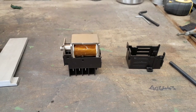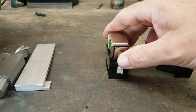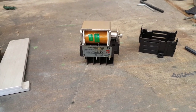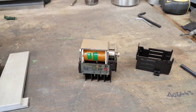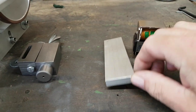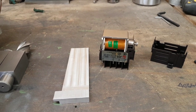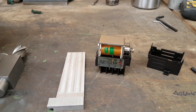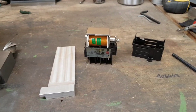Now all you sparkies and electrical fiends out there will probably know exactly what this is straight away - it's a contactor, eight-pin, 240 volt. It was supposed to be inside an oil-proof waterproof enclosure, but it was not - it was full of oil and the contacts inside have burned out. When I was machining my little square piece, I heard a knock from the mill and wasn't sure if it was the cutting tool or the mill itself. Eventually when I pressed start it wouldn't go - the knock was the motor engaging and disengaging because power was going off every 15 seconds due to the contactor failing.